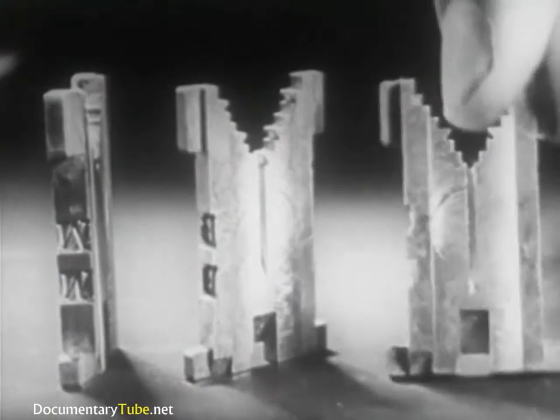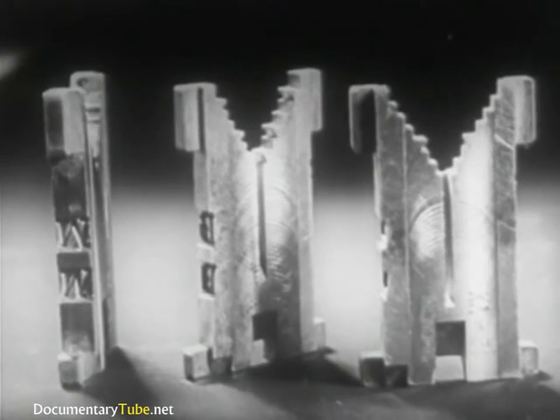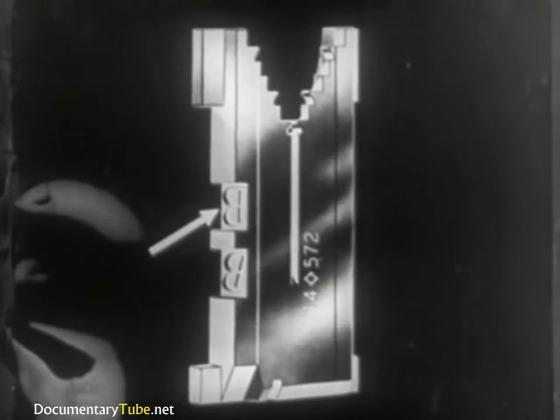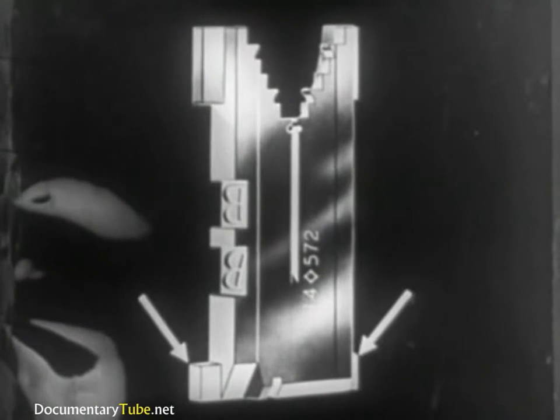Here is a close-up of some mats. You can see the letter that has been punched or engraved, into which the molten type metal is going to be injected. Note particularly the two punched characters — one Roman in style and the other italic — and the small lugs and ears which guide the mats through the various passages and assure the alignment of the letters.